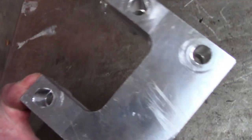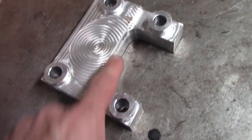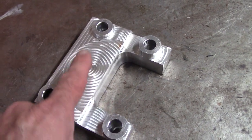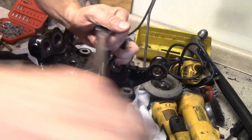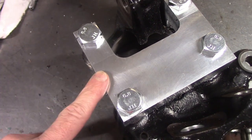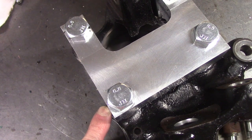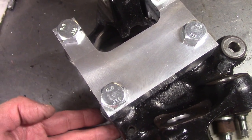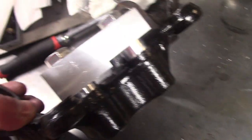The result of all that machining is this part here. It has four bosses on it to stand off the spindle, and it has clearance for the strut mount. This also keeps the part off the fixture so when I'm putting a hole through the spindle, it won't machine into the fixture. This simply allows me to put it into a vise. Here you can see how the fixture plate bolts to the back of the spindle — the holes happen to be the right size for a 14mm bolt, so I just tapped the holes and the bolts go directly into the spindle. It works pretty well.